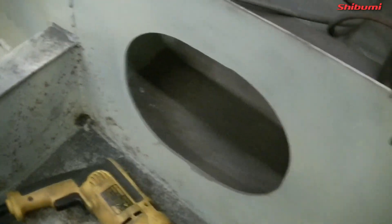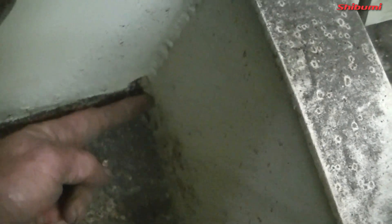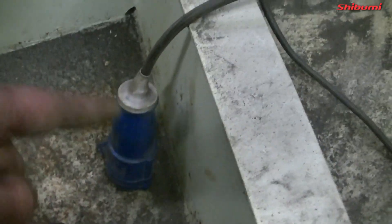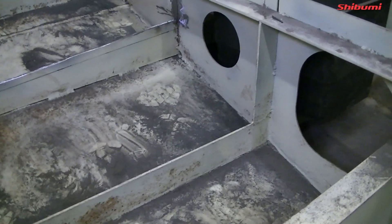I'm going to measure up the holes for these and then cut them, because I still need to cut all of these out, close this up, and get an actual weld to the floor. I need to do the same there. This side won't need it on the outer part because it'll be welded solidly to the floor. It's only internal in the tank where the diesel can get out under the stringer and seep out the vents if there was a leak. But remember, this tank is going to be air pressure tested severely before I'm totally happy and painted.